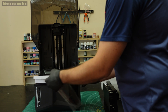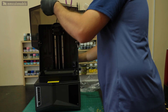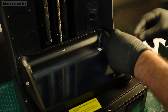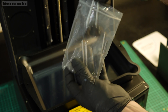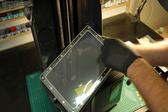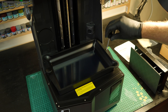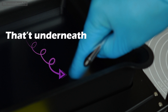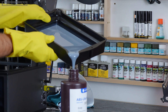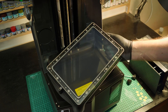This printer is packed with nice features, like the build plate which is laser etched, which should provide excellent bed adhesion. The vat is nicely secured in place with some foam, and why this is necessary we will see in a bit. It is also fastened with transport bolts and those should be replaced with the familiar thumb screws. There are several protective sheets that need to be peeled off before the printer becomes operational. One thing I don't like is that there is a max fill line only on one side of the vat, but the vat can be installed both ways. There are pouring cutouts in the vat, which is welcome when the resin needs to get back into the bottle. Also, the vat gets perfectly located in place via 4 protruding bolt heads that get into corresponding slots in the base.